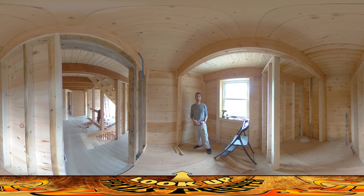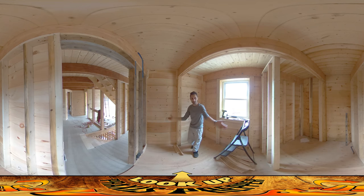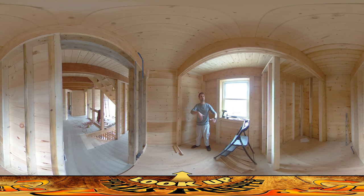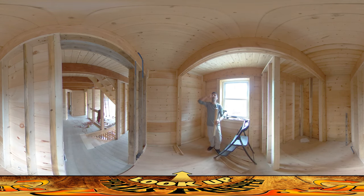My primary goal right now is to do all the stuff that the plumber needs done before the plumber can come in. Because until the plumber's done, I can't do the electrical. Until I do the electrical, I can't finish boarding up the other side of these walls — you need to leave them open for electrical work and inspection. So in order to do carpentry I need electrical, in order to do electrical I need plumbing, and in order to do plumbing I need to finish this wall.